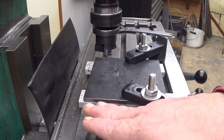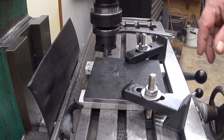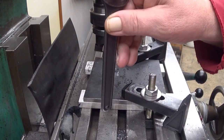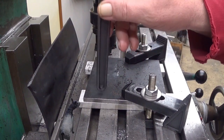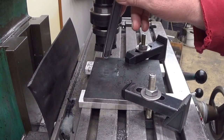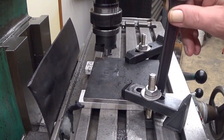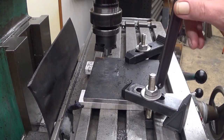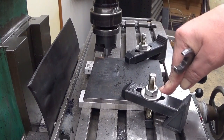So, I have now two parallels here under, on the planes I made to the other side. And now, if I knock these, first of all the milling table, and then this one, the sound is similar. It means that there is no gap under this. I don't know. Let's see. The same here. This has a gap here. This doesn't. So maybe there is a chip or something under, but there is definitely a gap under this corner.